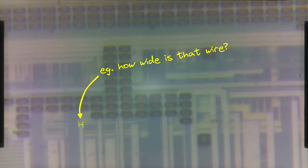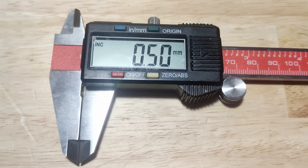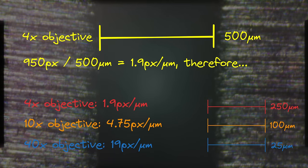While looking at small things under the microscope is fun and all, often times it's necessary to know the size of the thing you're looking at. So to figure out the scale of things, I set the microscope to the lowest magnification and set my digital calipers to 0.5 mm or 500 micrometers. This allows me to extrapolate the scale for all other magnifications, and while it's not the most precise method, it will do for now. I also found a feature on an IC which easily allows me to determine the smallest feature this microscope can resolve. At line number 20, the width of the thin line was around 550 nm, and because number 12 seems to be the smallest continuously resolvable line width, it would appear that the microscope can see things as small as about 320 nm — which is... okay. Just okay.